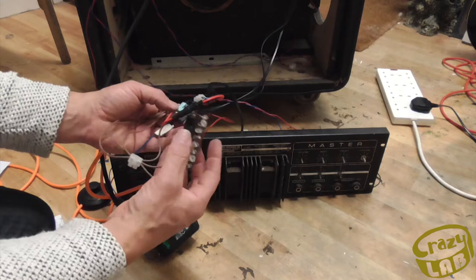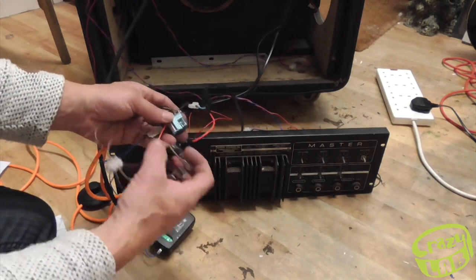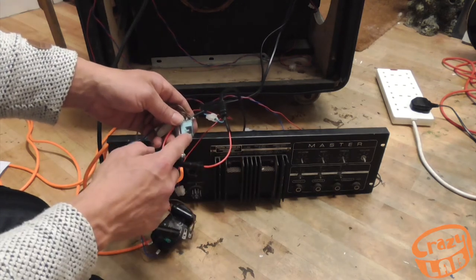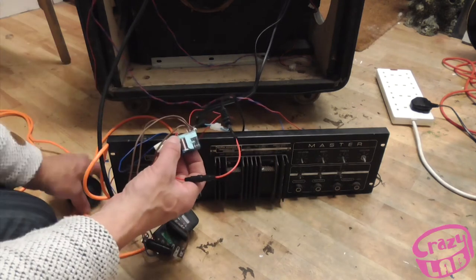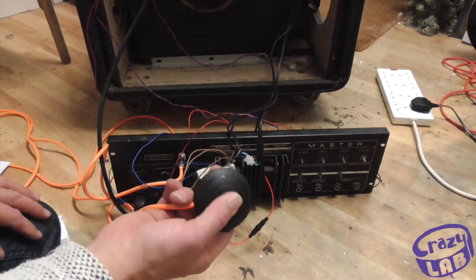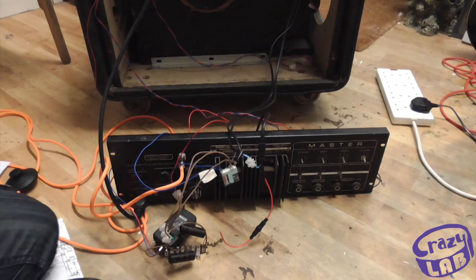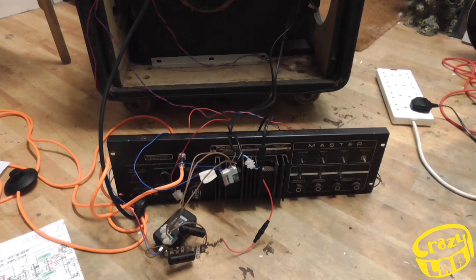You're going to need a couple of 600-volt DC capacitors. They will stop sparking and a big bang on your speakers every time you switch from high to low speed, and they'll protect the windings of the motors as well. I'll just use the foot switch which comes off there, so I'll plug the guitar in once I've soldered that back on and see how it sounds.